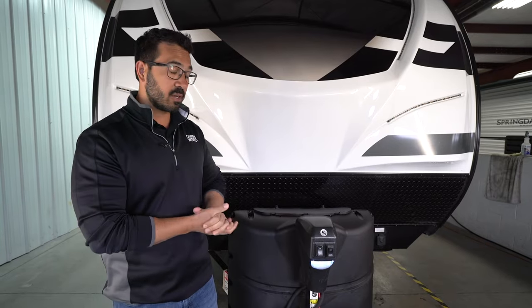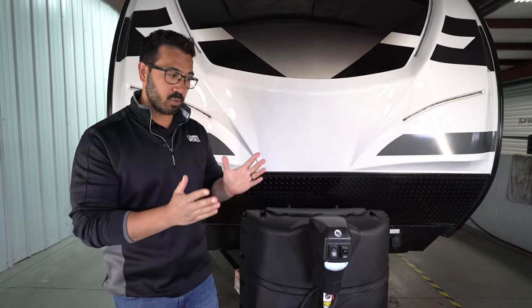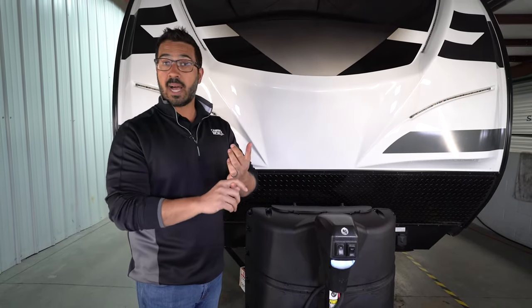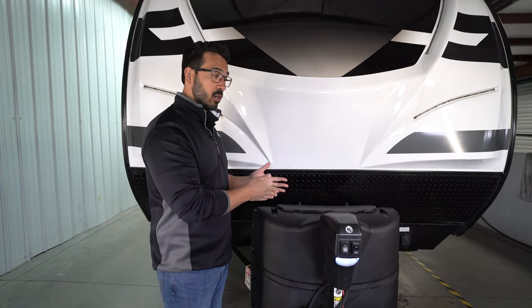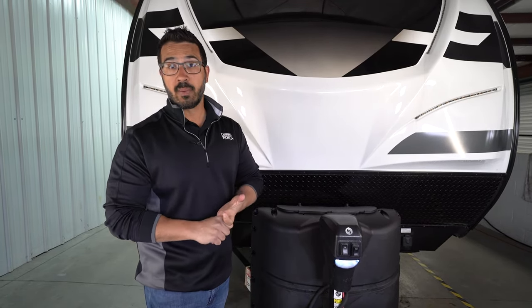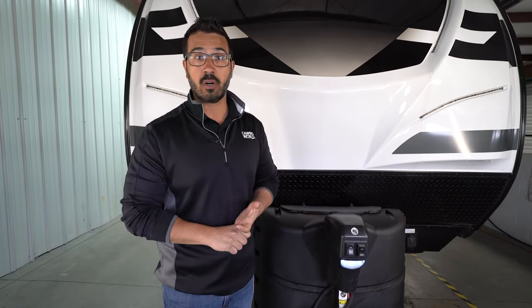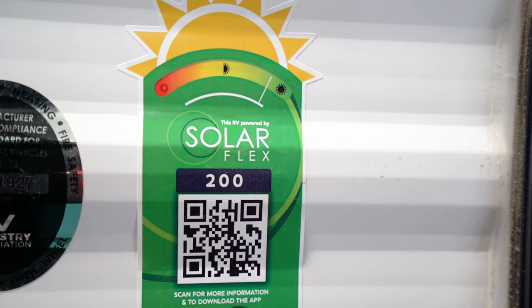You'll still want to get your camper in for a 12-volt system check — take it to a dealership once you're done camping. Either it's not getting charged in transit, the on-board converter isn't charging the battery, or you've drained the battery down so far that it's no longer taking a charge. That's why a lot of people have solar panels on their RV, to prevent that exact issue.